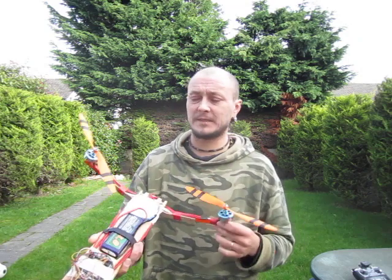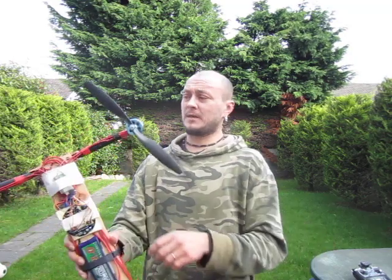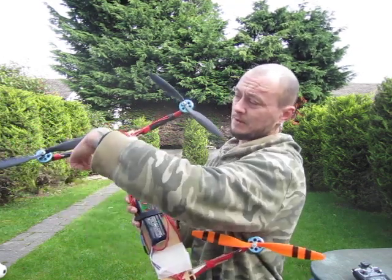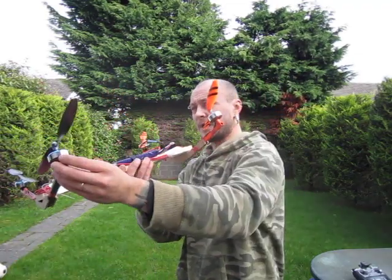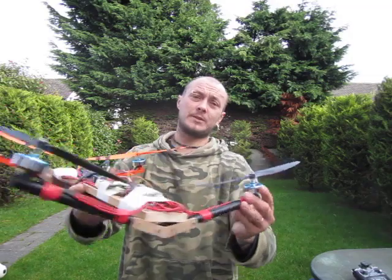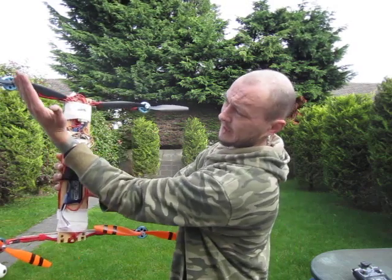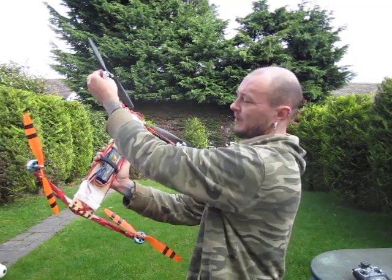It just didn't fly — it was just flipping over. So I figured out what the problem was. On most controllers the first motor is the left front one, it turns clockwise, turns right. So the torque yaws left, but the tilt also turns right. So the torque wants to turn left and the tilt wants to turn right — that's what was screwing it up.